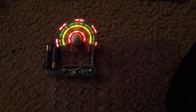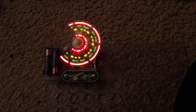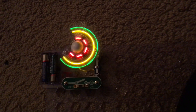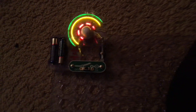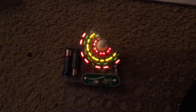Project four is dim light show. I removed one of the battery holders and replaced it with a three-snap wire. When I turn on the slide switch, the light show produced by the light motor is not nearly as bright as in the previous project, because there's only half the amount of energy being supplied to the motor. You'll also notice that the blue LED does not come on — that's because it requires the most energy to light. Red LEDs require the least energy, so they will typically be the first to come on if you were to gradually apply current to a circuit.